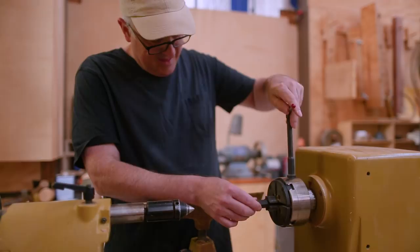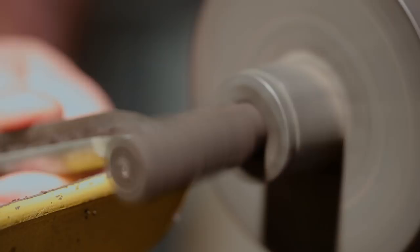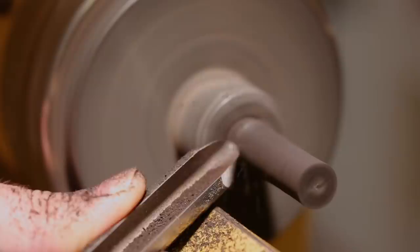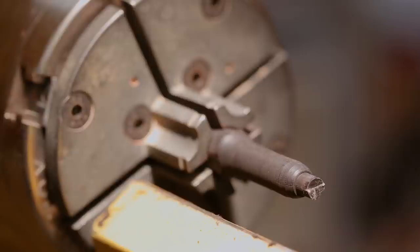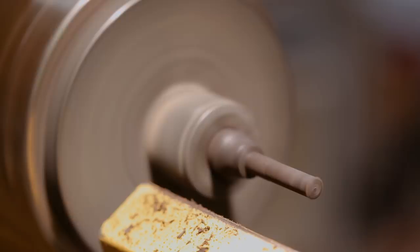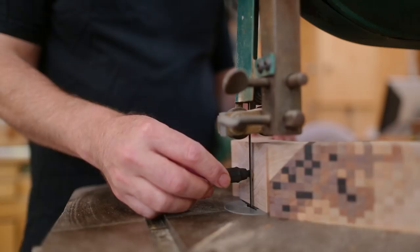I can turn one side a little bit round, then turn the piece around in the chuck — the chuck will hold that round part a little better. Then I can turn the cylinder that I need. Really it's just a matter of getting to something that will fit in the hole that I've drilled in the piece it's going to go into, so I can do the end and check that first before I do the rest of it. Once I have that set, I can do the rest of the cylinder. This super-dense, super-hard ebony is just really nice to turn. So I have my little dowel, and I can just glue that into the hole I drilled. Once that sets up, I can cut off any extra bit.